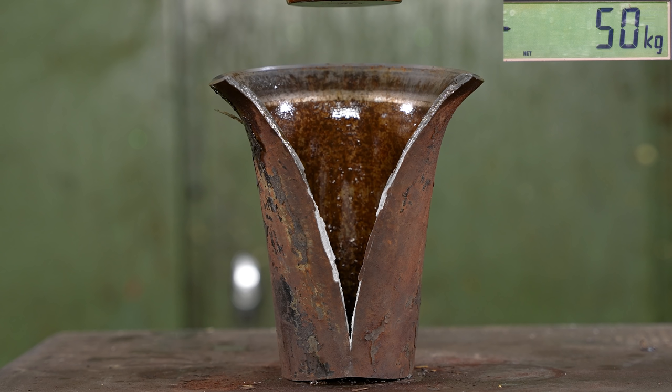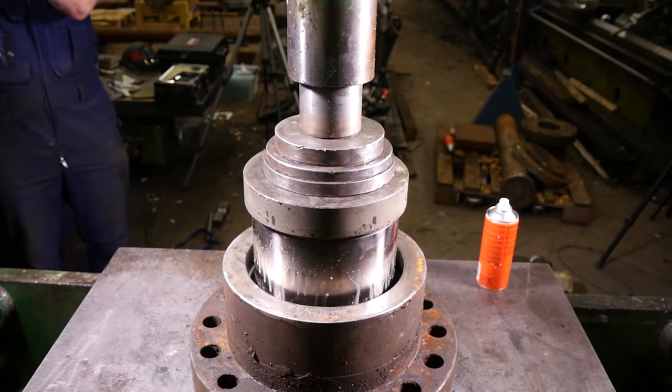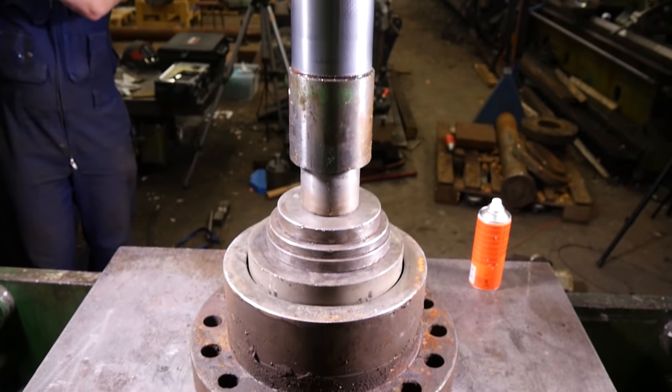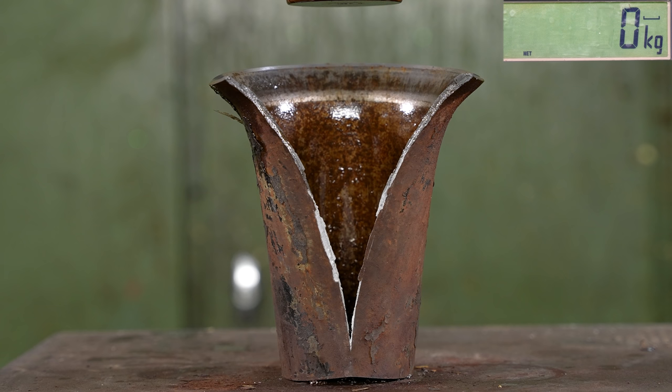If you want to see part two with thicker pipes, please let me know — it's going to be a lot of work. With a thicker pipe, it's going to be more about how many millimeters we can stretch it before the force becomes too large. This is actually pretty close to the typical use of the press here, because we quite often press fit things. When press fitting items it's usually like 0.2 or 0.3 millimeters too tight — completely different ballpark than what we tried today. Even the first test was about 10 times tighter than it should be. But that is all for today — thank you for watching and have a nice day. See you next time.